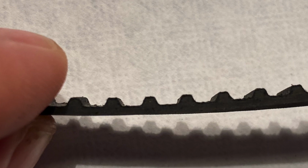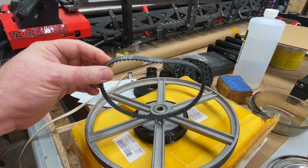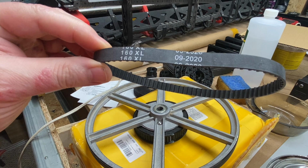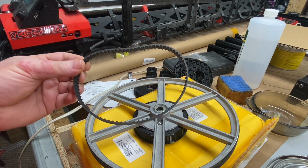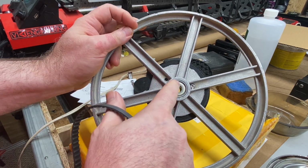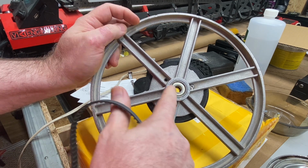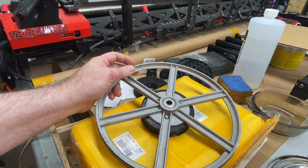The toothed belt bought on eBay is made for a Harbor Freight belt sander, model 38123. And you can see here it says 160XL09-2020. I'll put a link in the description for the belt. As carefully as I could measure, the distance between the center of the axle over to the shaft for the motor was 100 millimeters.